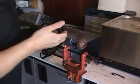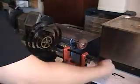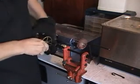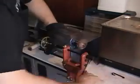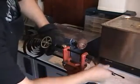What you see here is one of the main springs. We are now ready to wind it up. We've greased it and have to get it greased thoroughly throughout the straps. We're going to wind it up and get it ready for installation. This is a special mainspring winder called the Webster, and what this does is it allows us to wind the spring up. We're going to wind it up and let it down a couple of times, and that's going to spread the grease thoroughly throughout the straps. It's important that these wind up nice and straight, and that's why you wear a glove. You can see the grease in between the straps — she's spraying together very nicely.